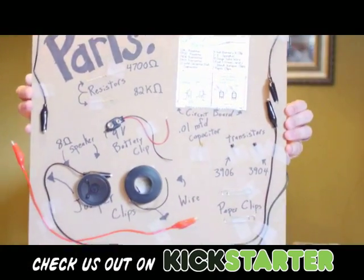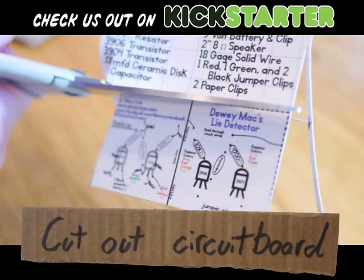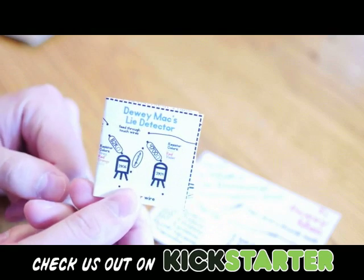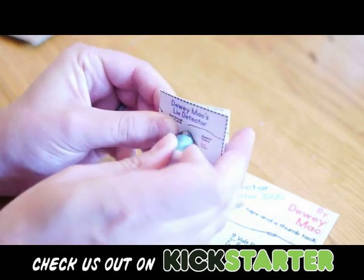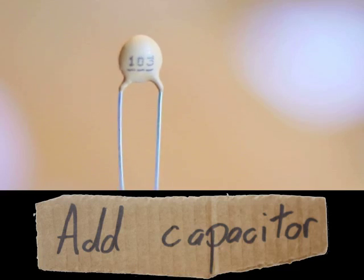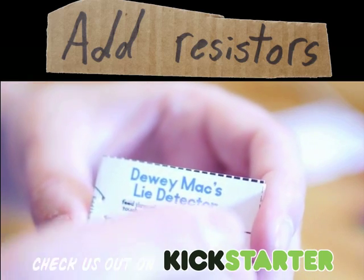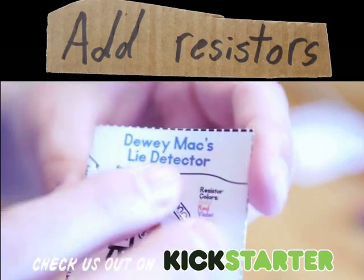Here are the parts cut away. Now what we want to do is fold along this line, and then that's your circuit board. Take your circuit board and with a thumbtack, just poke through all those holes. Put the two leads of the capacitor right in there like that. Now do the same thing with your resistor — fold that over and just poke those two leads right through.